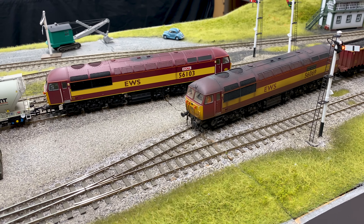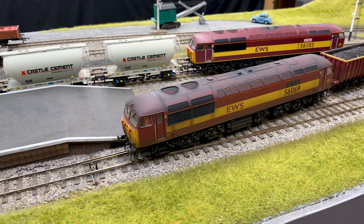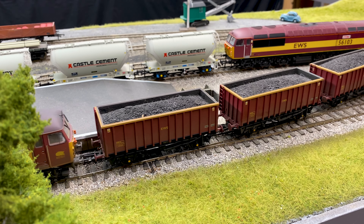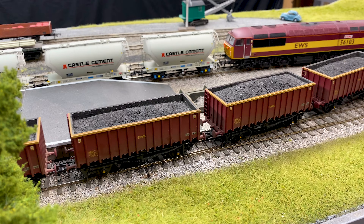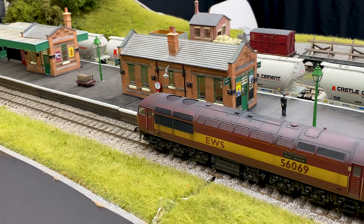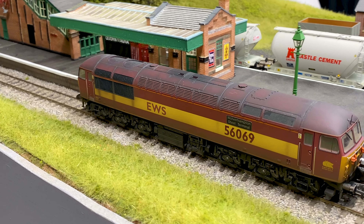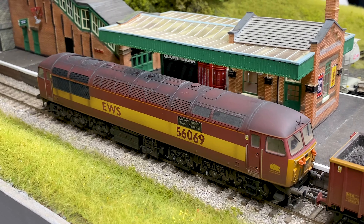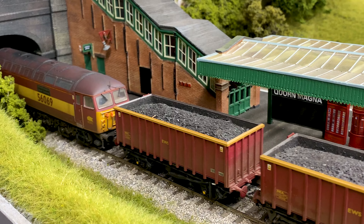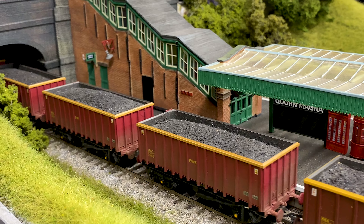Yes, so this is our first full installation guide. We've done a couple of installations prior to go with the issue content in issue 191, and this time we've gone into full detail showing how you can actually put the decoder in and the speaker in as well, connect it all up, and most importantly talking you through how to use the app to complete the setup for the decoder. This being an older generation Class 56, it's done with an 8-pin decoder. It's still got all the brilliant functionality of any of the other TXS Bluetooth decoders, with the Bluetooth link, plug-in terminals for the speaker and the stay-alive capacitor, and a nice simple installation out of the box.